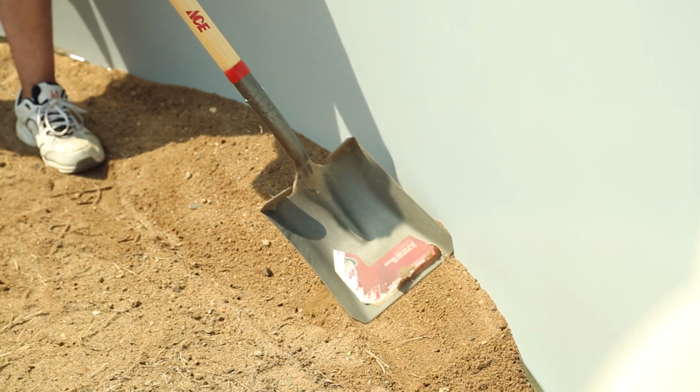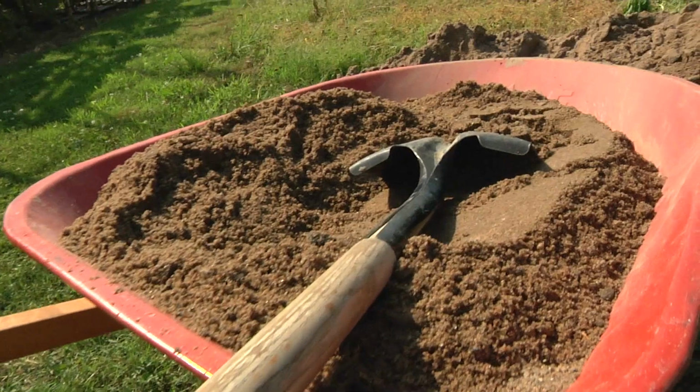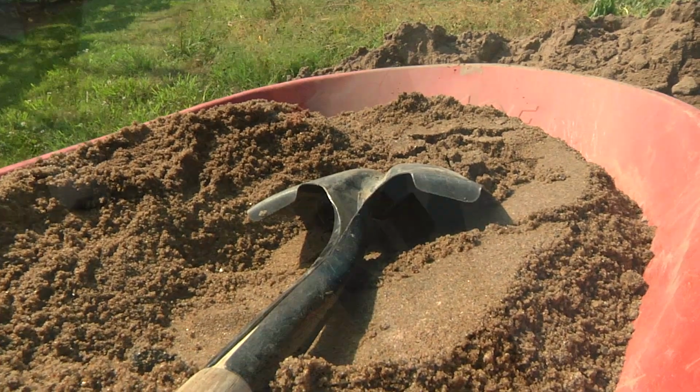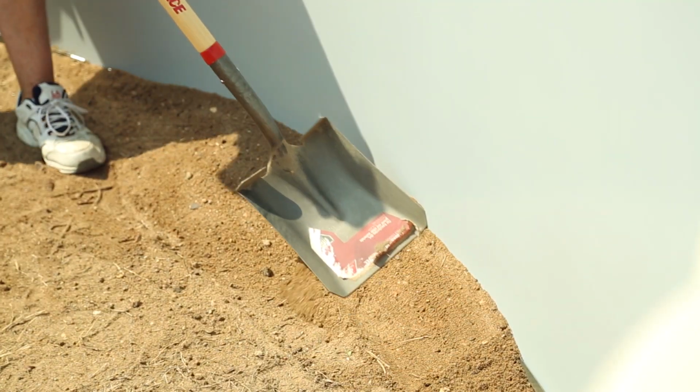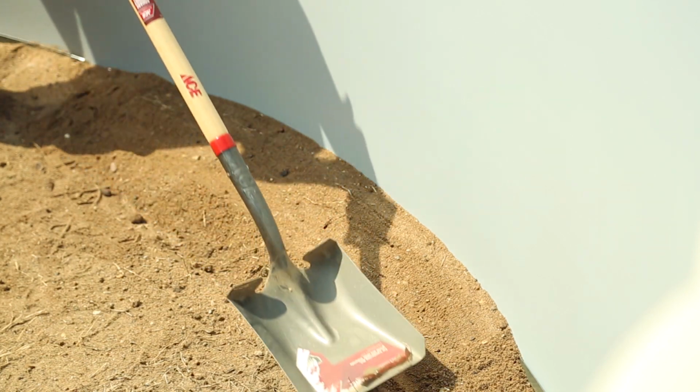You'll have the choice between 2 coves, packed earth or preformed manufactured. If you choose the earth cove, you'll need enough earth to build a 6-inch by 9-inch cove around the base of the pool wall. This video will go into greater detail about the cove later.